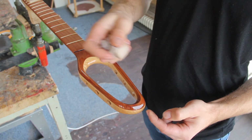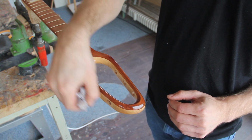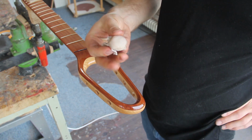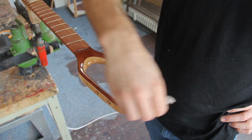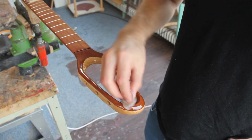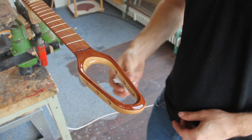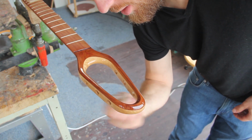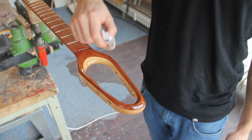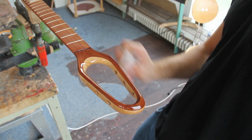It's quite hard to do the top of the neck, because I always have to have constant pressure on the surface, and it's really hard to go around there and have constant pressure. So what I sometimes do is do little circles around this place. Also, I could say I've designed the guitar for French polish so I can get in there, but actually I didn't. But it's quite good to polish, because there are no sharp edges, no corners. Everything flows like the pad.